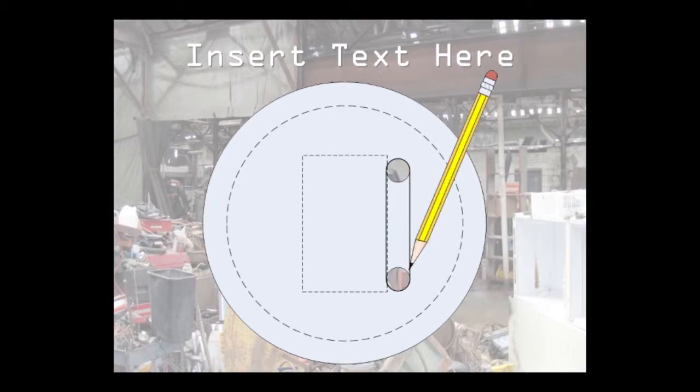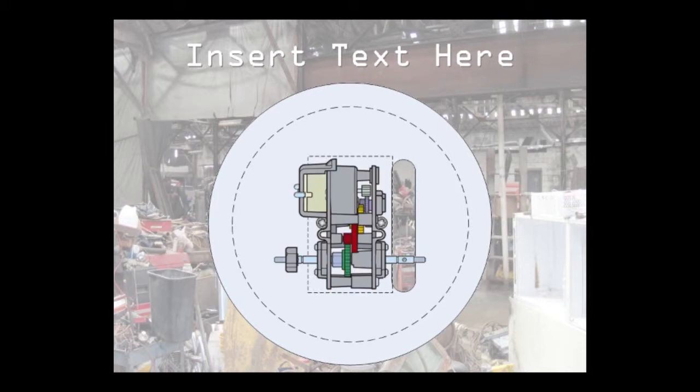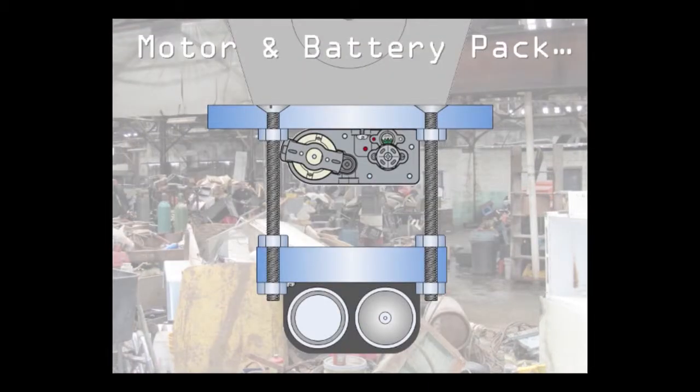Drill a second hole. The slot gets cut out between the two holes. Mark it with a pencil and cut it out with a jigsaw. Four 1/4 inch holes, countersunk, need to be drilled through the base plate and through the 1 inch thick disc. Use four 1/4-20 by 5 inch machine screws to secure the wooden disc below the motor. Fasten the battery pack to the bottom of the disc.